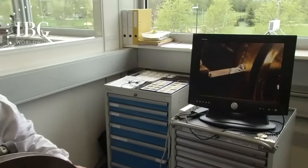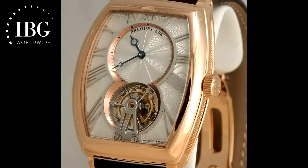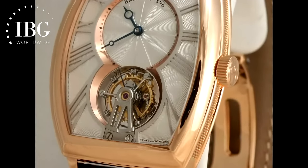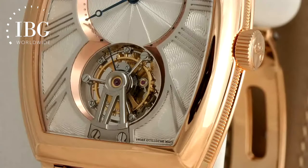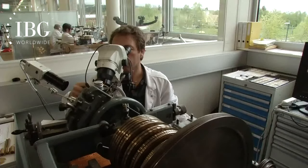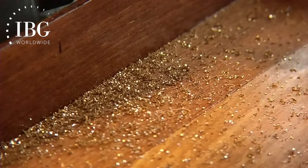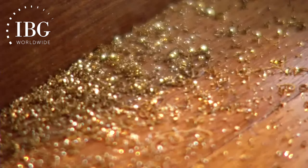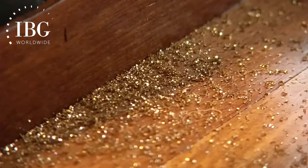He's working on one of the more difficult patterns for the Breguet Heritage Tourbillon, which has two different guilloche motifs. One is called flammé and the other is called drapé moiré. These are two of the most challenging to create, but he's doing both on the same dial because he does the entirety of the dial. There's a byproduct to the guilloche work — little bits of gold that are in fact being cut out of the dial as the pattern is created. Those bits of gold are saved and recycled.